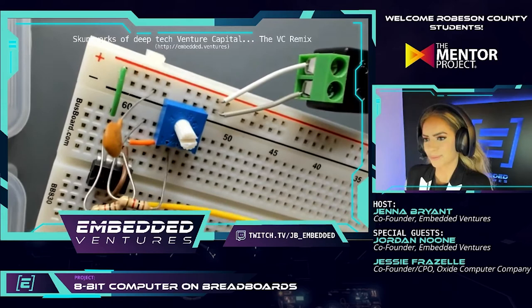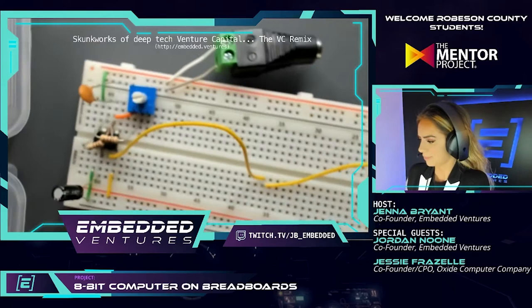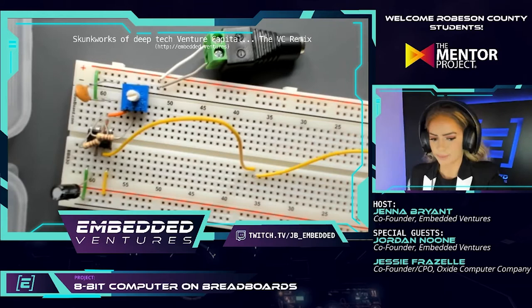That's the first one she put together. The potentiometer — that blue part on top of the board — you can actually rotate the knob to get a variable frequency. You're changing the resistance of the potentiometer, which changes the timing of the circuit Jenna built. Today we're going to start building a second circuit built on top of the 555 timer.